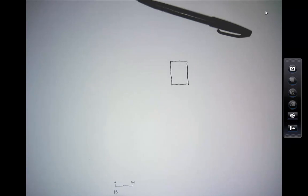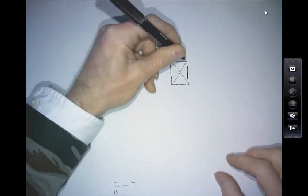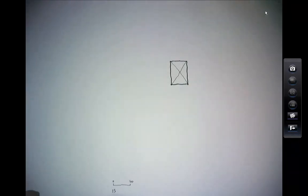The projection is just squashing things slightly here, so if I draw a square it'll look slightly squashed, but we'll continue anyway. There's my timber member. Looking at the detail I'm basing it on, that is not drawn as a glue laminated member — it's actually drawn as a conventional piece of timber. I draw a thick line around it to indicate it's structure, that I've chopped through it.